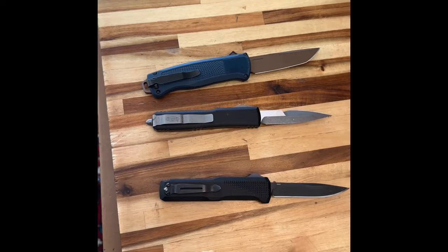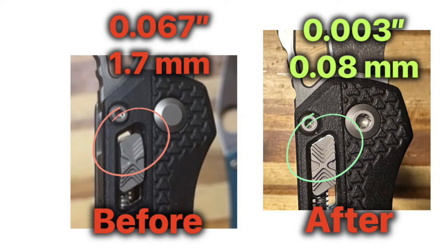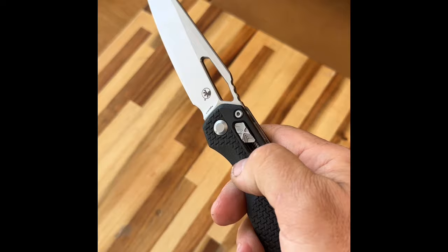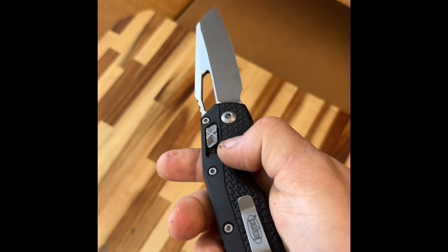In conclusion, before I started on this project the gap was 1.7 millimeters, or 0.067 inches. After I finished, the gap was reduced to about 0.08 millimeters, or 3 to 3.5 thousandths of an inch. The action on the unlock is just as slick as it was — no complaints. My hand is healing and this is now my current go-to EDC.